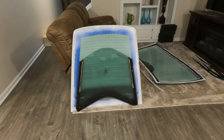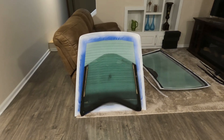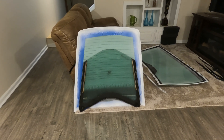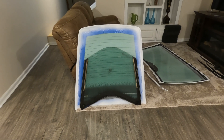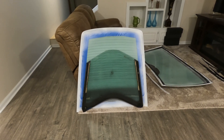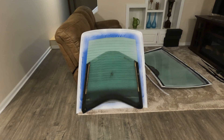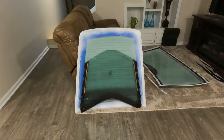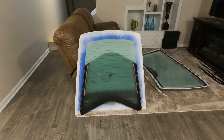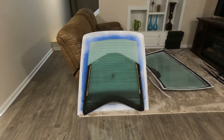Since we're going to be making a new car body design, I was struggling with the size of the C7 rear glass — Fatal was having some issues getting the body design to work correctly because of the length of the glass. So I decided to purchase a rear glass out of a C8 Corvette, which is the one you see in the front. You can see that the C8 rear glass is quite a bit smaller than the C7, in both width and length, and it has a cool shape to it. So this is the glass we're going to use in the rear. I'm going to sell the C7 glass. I need to model this C8 rear glass — I'll get a piece of wood set up with a grid drawn on it and plot out all the points around the perimeter, like I did on the windshield and back glass for the C7. That gives me a pretty accurate representation of the curvature and the overall perimeter shape. I'll be doing that actually tomorrow.